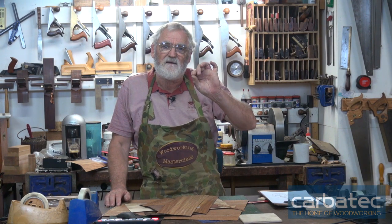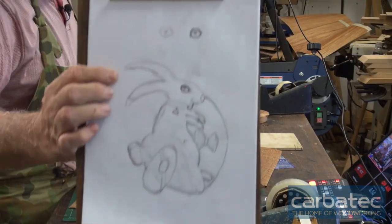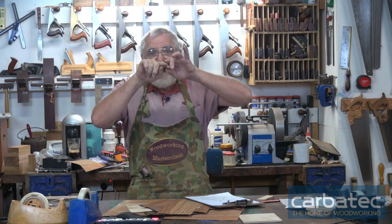The technique I'm using I'm not sure what it's called. I learned it from a furniture maker and fantastic marquetry artist, Silas Koff, several years ago. It's building the piece piece by piece. With this particular project there would be a lot of what they call piercing work, which means you cut into the job and cut a piece out and place it in. This process requires a minimum amount of piercing — you piece the job together bit by bit and it grows. It takes a while to get your head around it.